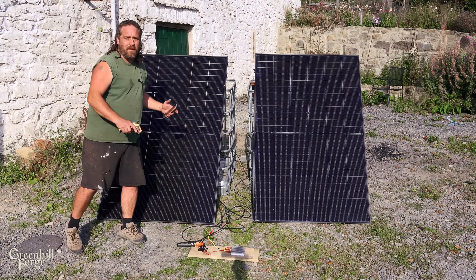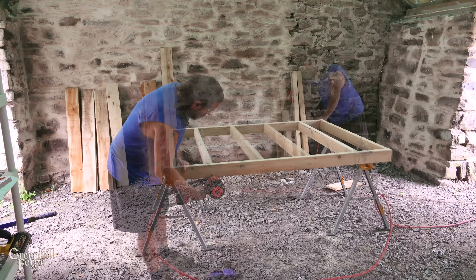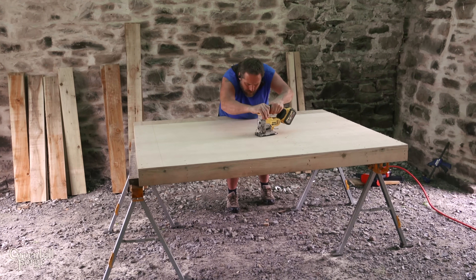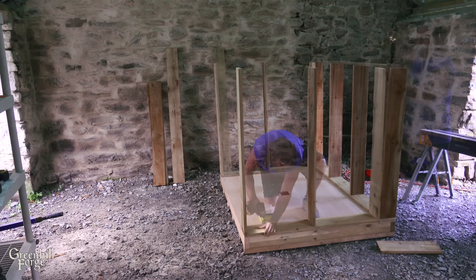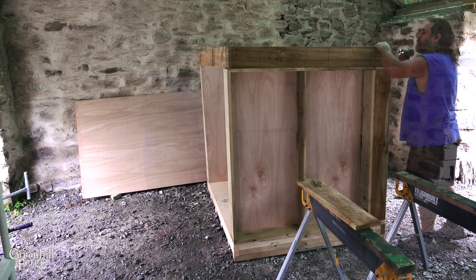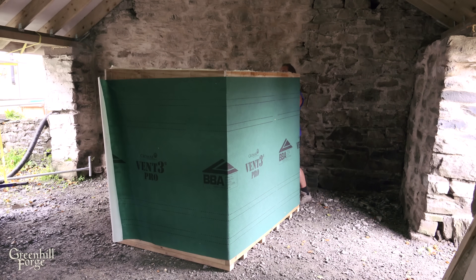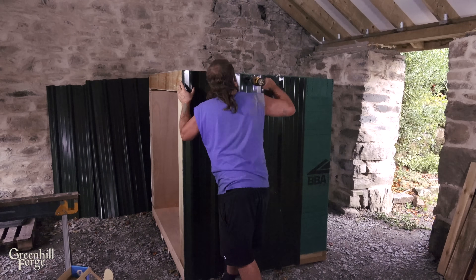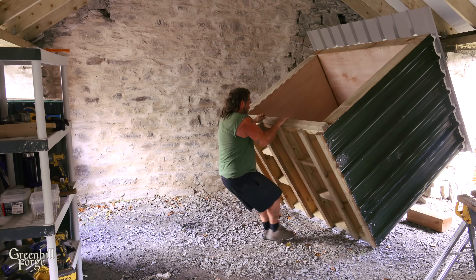Now I need to build a kiln and get the heating element hooked up to it. The question is: is that heater enough to warm the kiln? I'll start by framing up a basic platform and add a hole in the center where I can mount the heating element. I'll put some risers on the bottom so that I can get forks under it, and then I'll frame the whole thing like a basic small shed. The inside will get clad with plywood, and then the cavities will all get six inches of insulation.